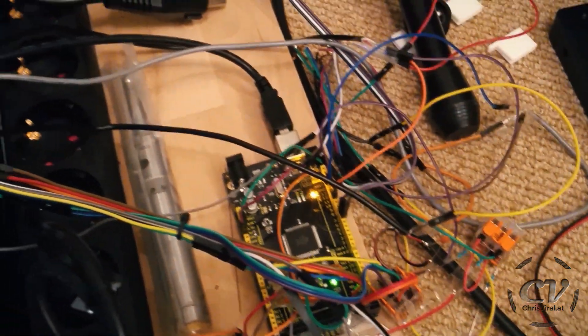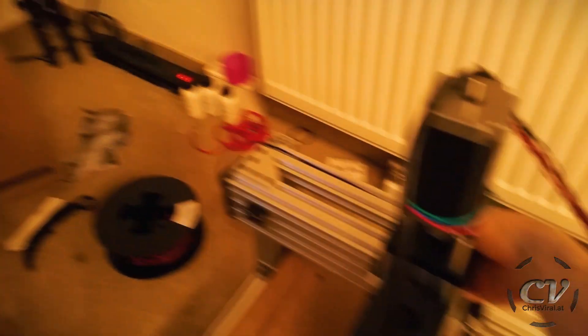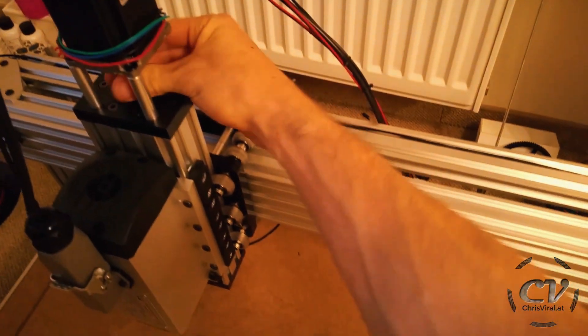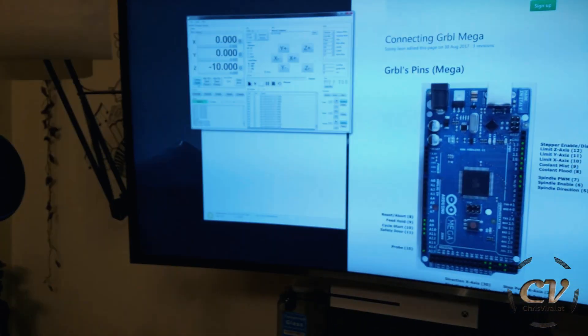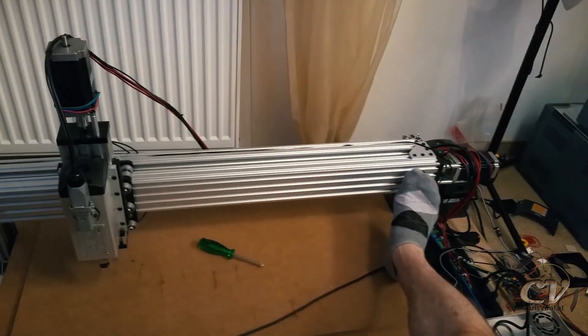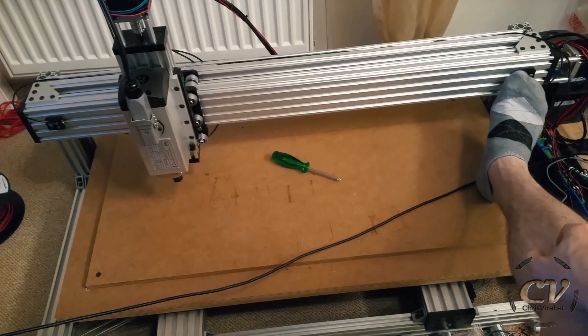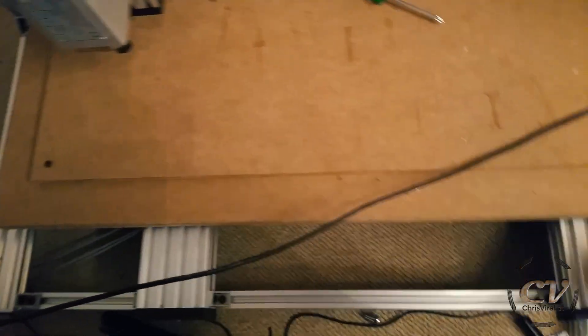I just found my mistake — my wiring was a bit off. My Z limit was actually wired as my X limit, and that's fixed now. So I'll hit the home cycle and click the limit as fast as possible, then return so I can hopefully stop it if it's not doing what I want. It's not working — stop stop stop! It's actually still wrong because if I start the homing and press this switch it works — so I just need to fix the wiring.